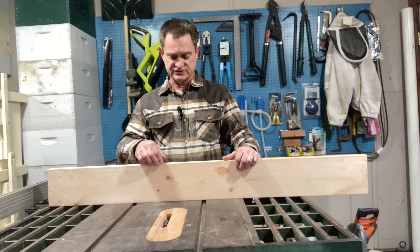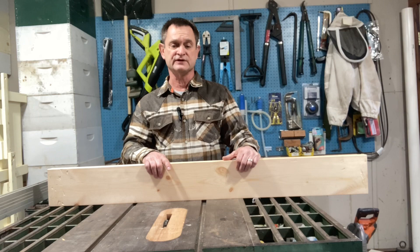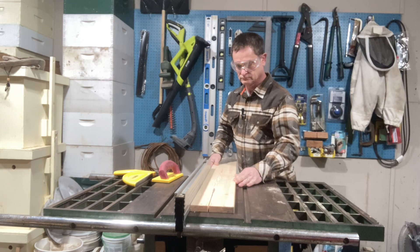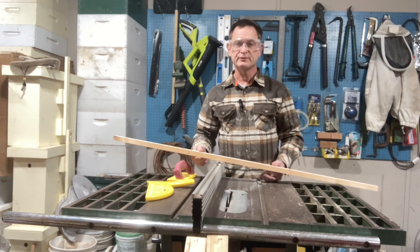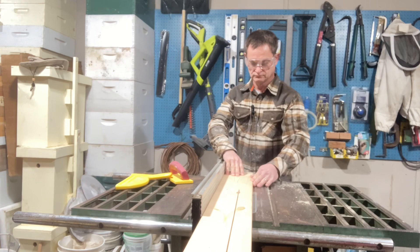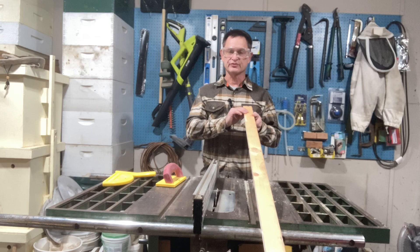Initially, I'm going to rip these boards down to two-and-one-quarter inch pieces. Those will be for the end boards and both sides. Then I'll rip the next one down to three-and-a-half inches, which will be perfect for the shelf. After ripping the two-and-one-quarter inch pieces, the remaining piece is three-quarters of an inch wide — I'll be able to use that for the slats. I'm then able to rip two more three-quarter inch pieces out of the waste from the three-and-a-half inch piece.